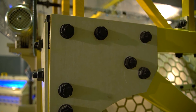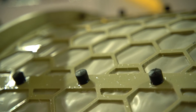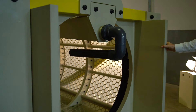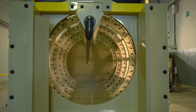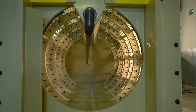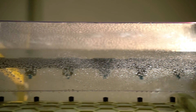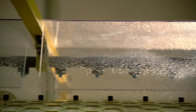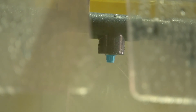The chassis is made of GRP. As mentioned with the previous unit, it's possible to make frame or tank type, and we can go with flange connection or channel connection. On top we have a completely transparent splash cover for backwash, because the backwash water comes in at 7 bar to ensure all the mesh is completely clean during the backwash cycle.